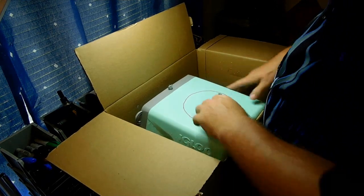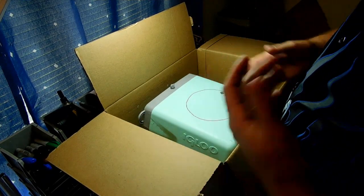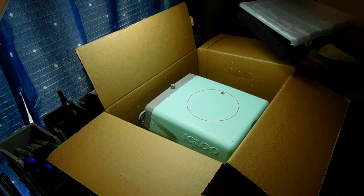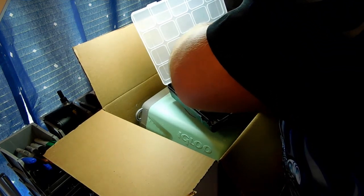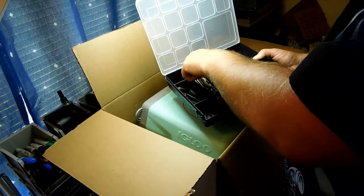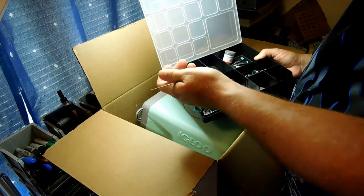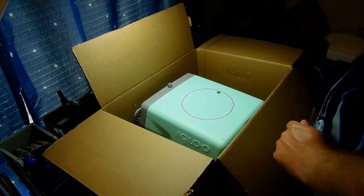Using the cardboard box makes cleanup a lot easier — especially if the weather's bad and you can't cut outside. Now for the jigsaw blade — you don't want to use a wood blade for plastic. Use a bi-metal blade with teeth a little bit wider apart. A fine-tooth wood blade will be hard to cut plastic with. Get a bi-metal blade for your jigsaw.